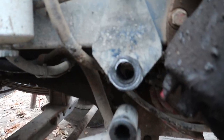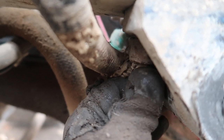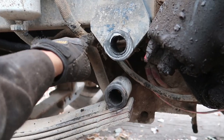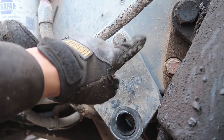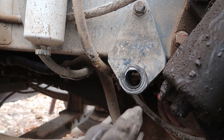I just got this all torn apart. I reached down to check the size — it's loose, and I don't know why it's loose; they're supposed to be tightened. We've got to replace those as well. These are only grade five bolts — three hash marks, which means grade five — so we'll have to replace those. The bolts underneath I don't have, so I'm going to put everything together. They should all be the same size. I'm going to pull the hanger off and compare — this old one is completely toasted compared to the new one.